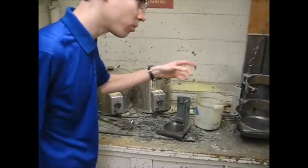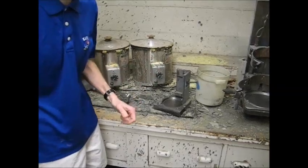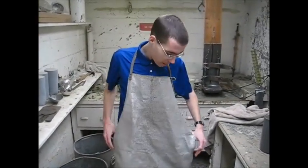These are our sulfur pots. They should be plugged in, set to 265 degrees. Don't mess with the temperature — it's fine where it is. You're going to want to put on some protection. That stuff is 265 degrees, not something you want to take a bath in.